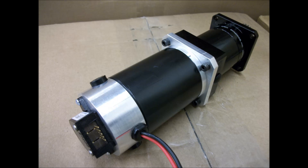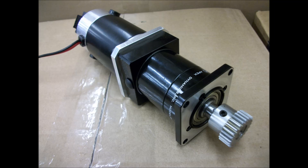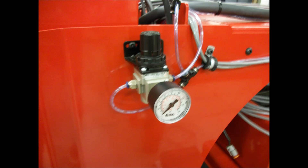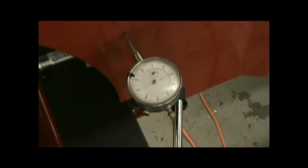The XLS systems use 200-watt US motors with encoders, while the XLR8 systems use Panasonic 400-watt motors with built-in encoders. Both systems feed power directly through low-backlash planetary gearboxes engineered for servo applications. The pinion gears are directly on the output shaft of the gearbox — no belt reduction is used. Big time value. The drives are engaged into the racks with air cylinders assuring no backlash or jamming. A regulator on the gantry allows for pressure adjustment. Cheap systems bolt the drives in place requiring backlash when assembled to avoid binding, resulting in sloppy cuts and poor positioning.